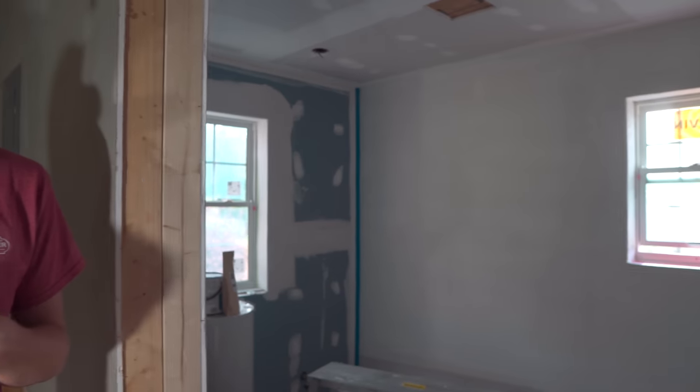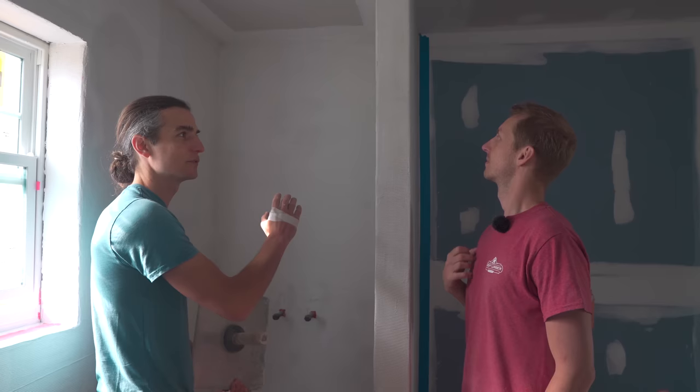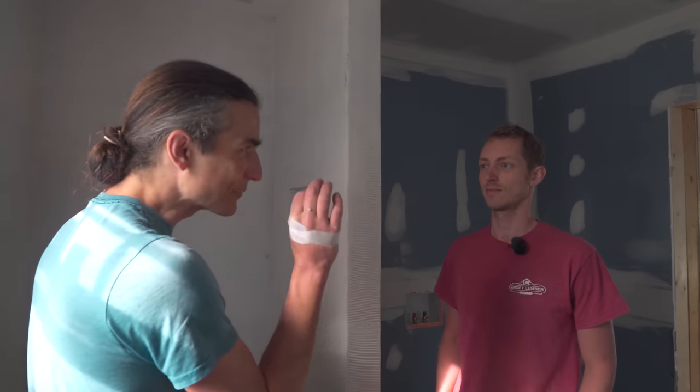That's our lime job. Yeah. Lime and TADELAKT. So we'll switch from clay to lime, because TADELAKT is lime, but it's a process of lime plaster. Right. That's what's so cool about lime, is that everything in earthen plasters is literally process. It's all the same material. Yeah, just like, is it lime as your adhesive, or is it clay? And TADELAKT is just a layering process. Right. It's just layer after layer, compression after compression, and that's what makes it waterproof. It's the same material as the lime plaster we're putting on here. It's just less of a process. Right. Different size aggregate.